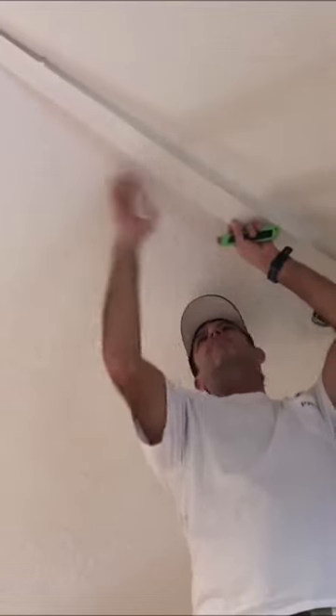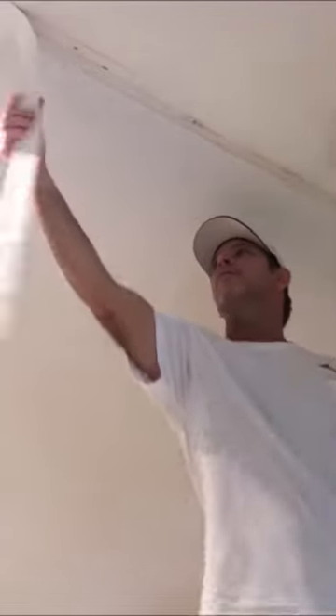For the record, I do always give my customers options on a repair like this. Option one would be to skim coat the whole ceiling and then respray the knockdown texture on the whole ceiling. That way there's no question if the texture is going to match or not.